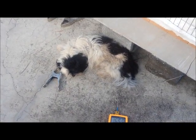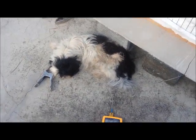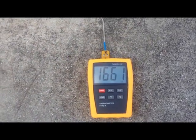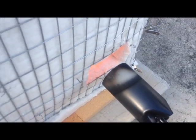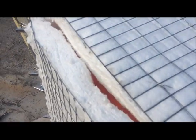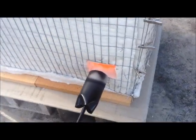My little dog Patches, 16 years old, is still hanging with me. I think she likes the warmth from this thing. Right now we're up to 1,661 degrees. I have cranked the burner up a bit. Believe it or not, I'm only at about 10% throttle right now. I did close the flue down a little bit — I figured it was heating up faster. You can see it's starting to glow red inside. It's starting to glow pretty damn hot.